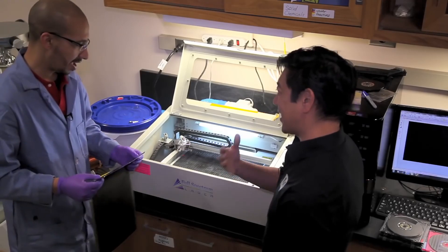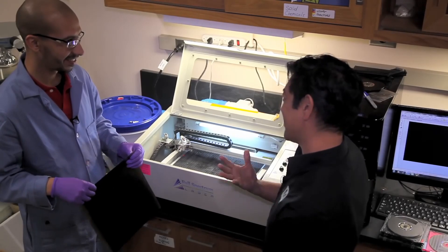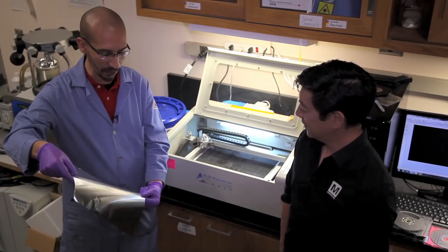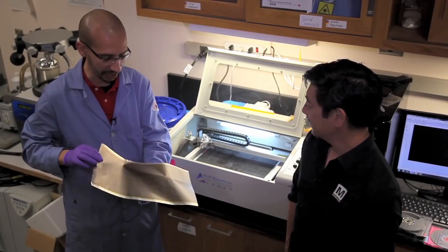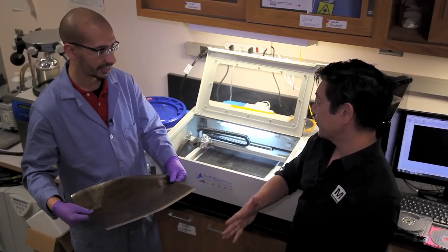You mentioned using a laser cutter at home for this fusing process — is that correct? It's the same thing. You can do the same process using a laser table because it's got a bigger area than a CD disc. So you can make more devices, on a larger piece of aluminum foil. You coat it with a layer of the graphite oxide slurry — same graphite, same material — just using a different laser. This laser is bigger area, so you can build larger devices and more devices. And you're not limited to a CD substrate — you can use whatever substrate you like.